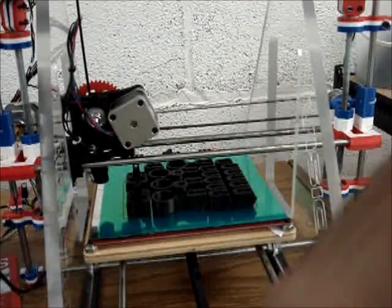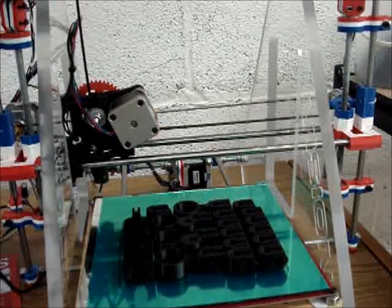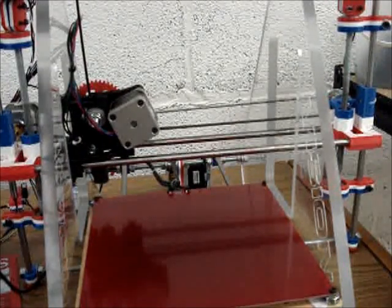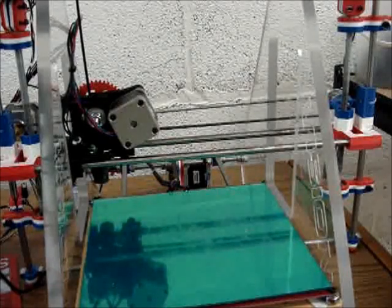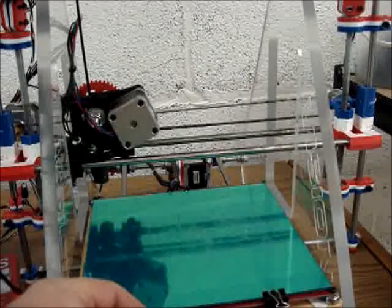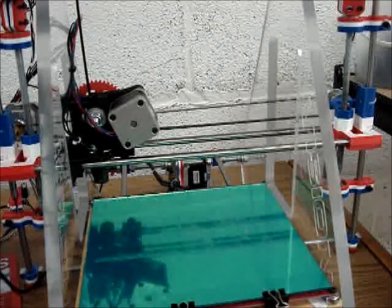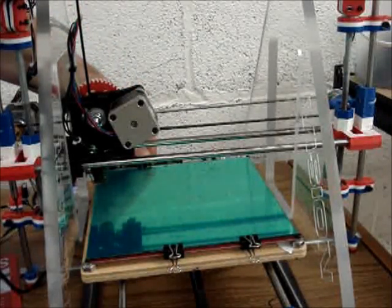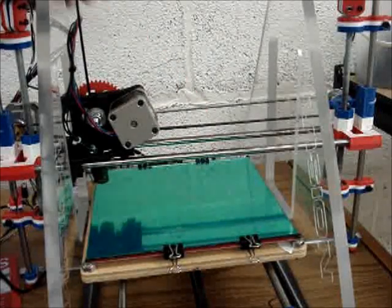Basically pull off the clips. The good thing about ABS is that it's practically hard now — the last pieces are probably a little soft, but just use those and pull the whole plate off, and put the next plate on. I like to have plenty of extra plates already good to go so you're not wasting time. I never turn off the heated beds — they are always hot, about 110 degrees Celsius. If I run it any colder than that, large parts like an extruder body actually start curling up on the ends, and you want it to be dimensionally what you asked for.